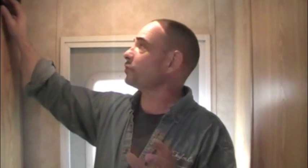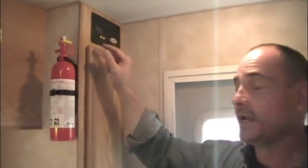I should also mention the controller has A and B buttons, which let you select the battery type: AGM, gel, or flooded. We always set them up on number one, which is flooded, but if you decide to change your battery type, you just change the setting on the controller so it knows what it's charging. It's a really neat system.